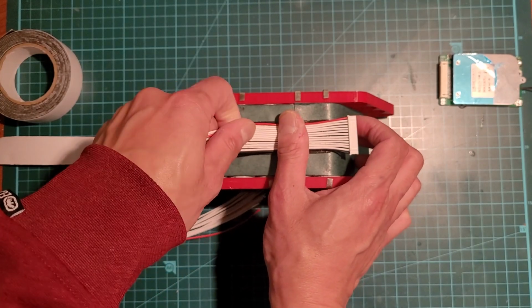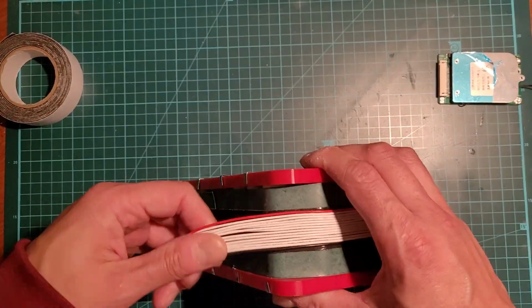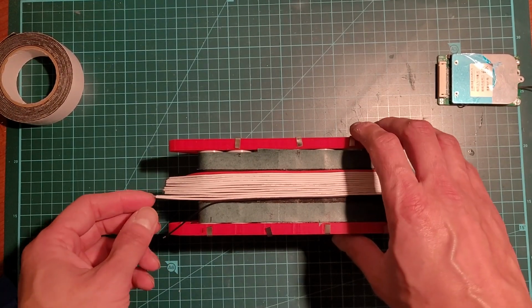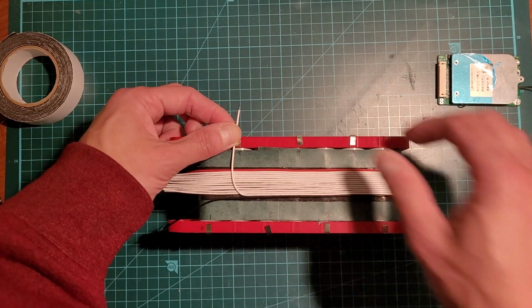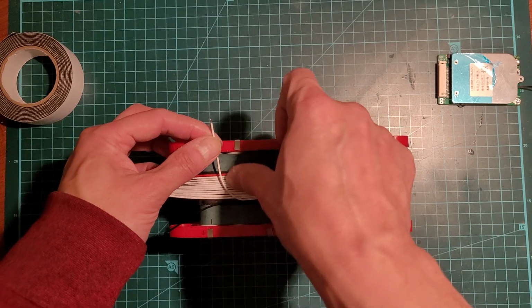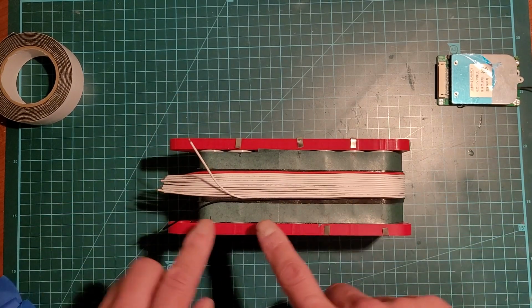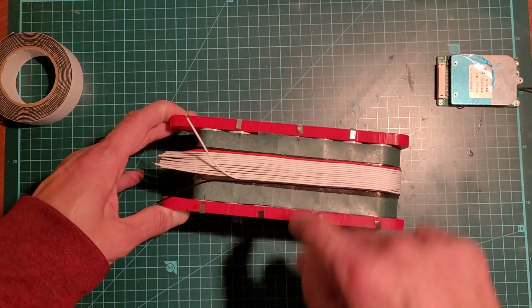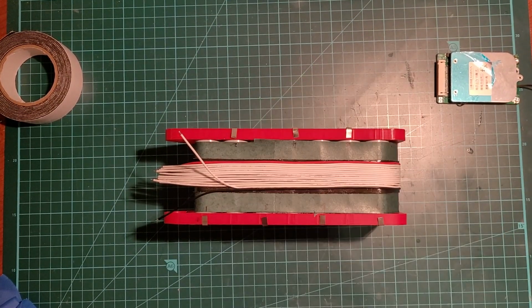Make sure these are flat. Negative. So it goes like that. Battery 2 is over here. Okay, so when I do this, I'm going to put some nickel, or some fish paper on top to prevent any sort of pinching. And then at the end, I'm also going to put some liner or some foam tape along the upper edges here. So it's okay if it's a little bit taller, but I just don't want it to be fatter on the sides because that's where all the pressure is going to be put on the Jetson.